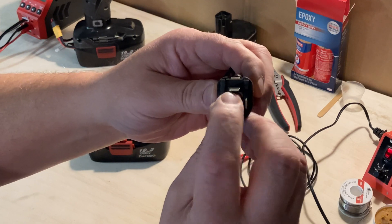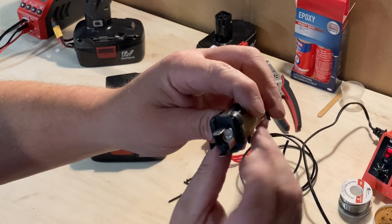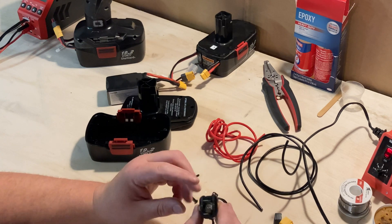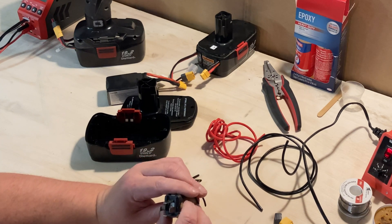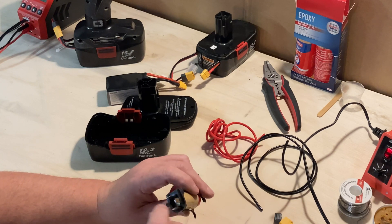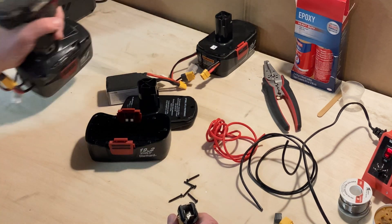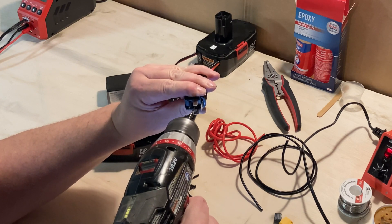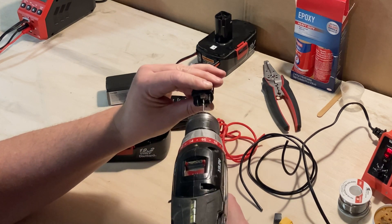If you look closely, there are two little spot welds inside there holding the positive terminal to the top of that cell. We've got to get those loose so we can reuse this top piece. What works pretty well is just taking a little drill bit and drilling those out — it's just tin so it drills pretty easy. Try not to go all the way through; just flex a little bit and break off the last piece, because otherwise you'll drill into the NiCad cell and might get some acid paste out of there.